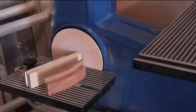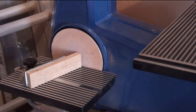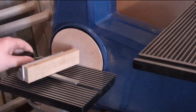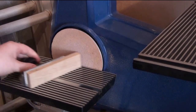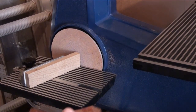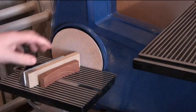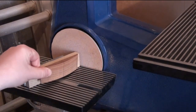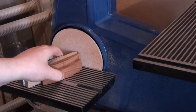The next part is setting up the disc sander. I've used an adjustable set square — like one architects use for drawings — to set up the angle at 18 degrees to the disc. Similarly to when we cut the segments out, because there's a curve on here, you can't put these segments against a straight edge and expect to sand them to the angle you want. So what you need to do is fix an off-cut on here to support the segments and hold them at the correct angle.